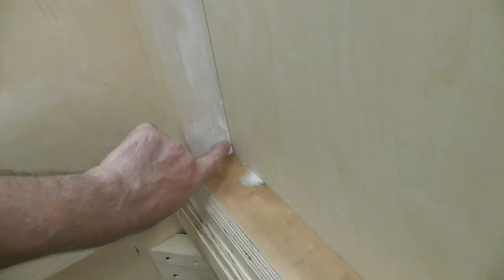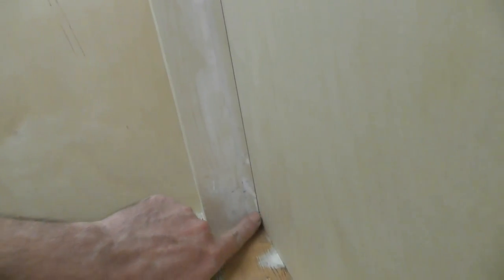I don't have this column yet — I'm getting ready to put that in. I did have a mistake here: my guide for my router slipped and I gouged way off into here. I took out a square section, made a piece, glued it in, did a little body work, and then recut that groove. You're not going to be able to see it, but I show my mistakes as well. A little bit of blowout here and there on the veneer from manhandling this stuff.